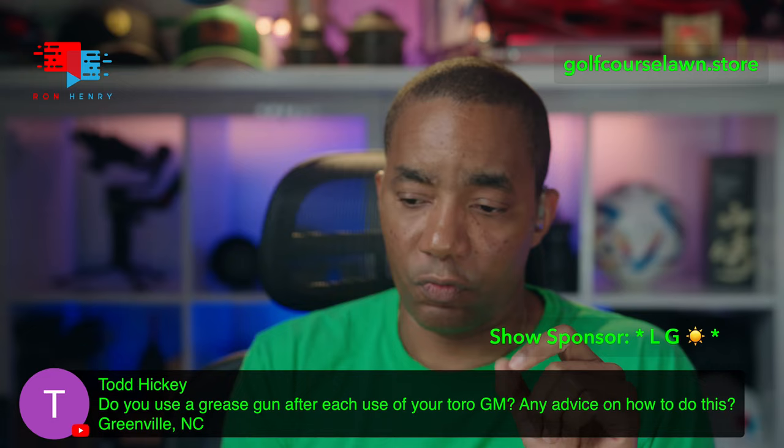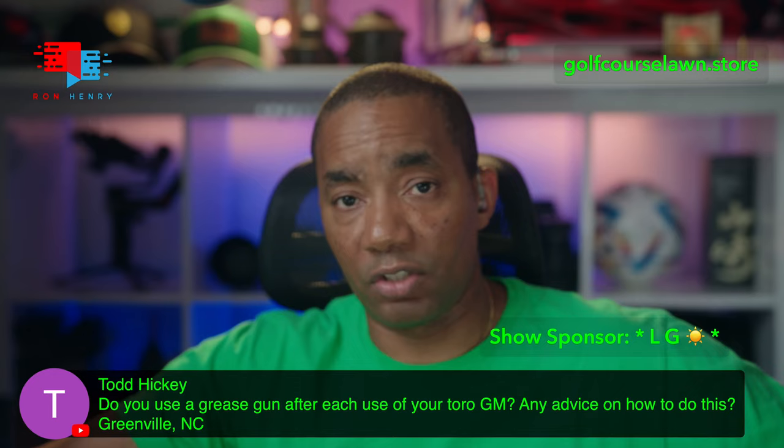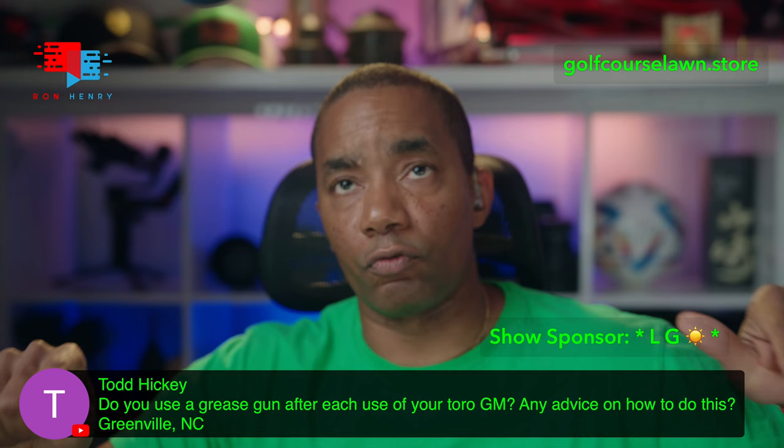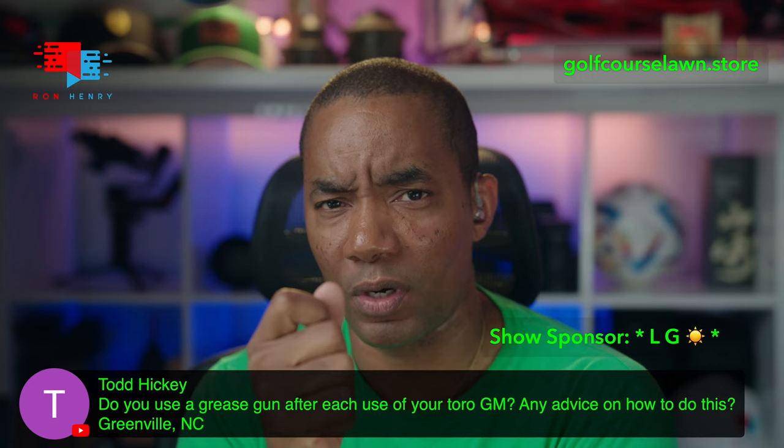the roller. I hit the ones that are, there's two bearings on each side of that axle that drives the pulleys that drive the drum. I get those. There's one on each side of the rollers that I get. And I want to say there's also one on the gearbox, the one with the little lever that you use to disable and enable the reel. I believe there's one on there too. Don't quote me on that one. But the other ones are the ones that I commonly do.